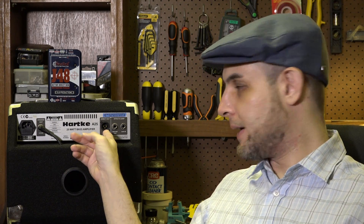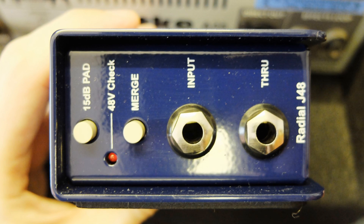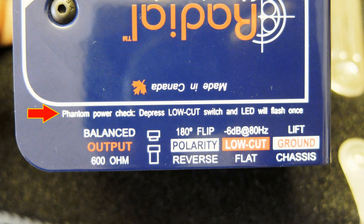What I'll do is unplug the line from the DI and plug it into the J48, then ask the person on duty to switch on phantom power to that line. It's normally off because the instrument amplifier DI doesn't need phantom and in some cases phantom can actually damage them. Now, the J48 has a small LED that comes on momentarily when you press the low cut switch. They don't leave the LED on permanently because they want all available power going to the circuitry in the J48.